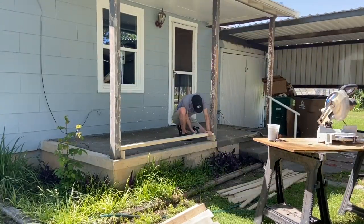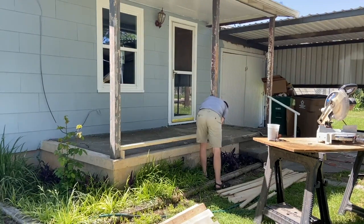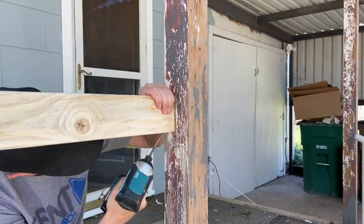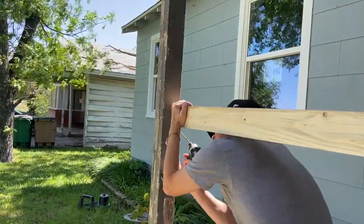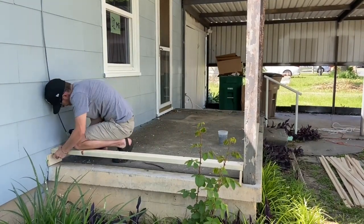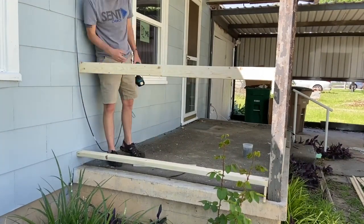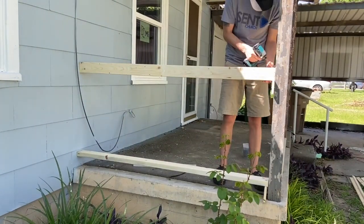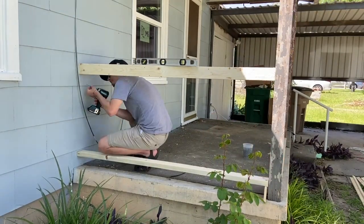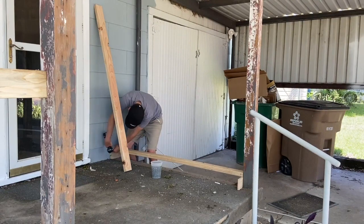So as you can see, the porch is pretty run down. It just had three posts holding up the roof and it had a carpet on the actual patio of the porch. I started off this build by framing out where the top and the bottom of the actual railing was going to sit. I placed the top board at a little under 35 inches so that when I come back with the cap, it'll be a little over 35.5. For the bottom board, I just used a scrap 1x4, set that in there as a jig, and just duplicated that around every post.